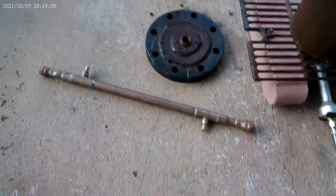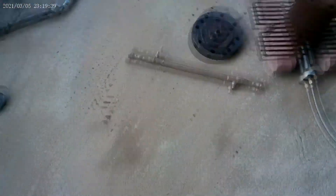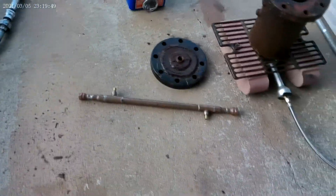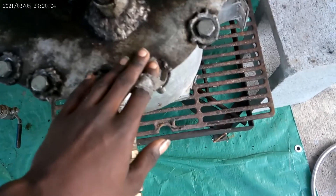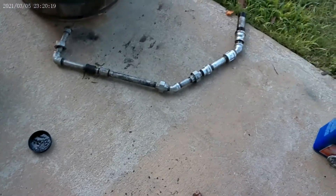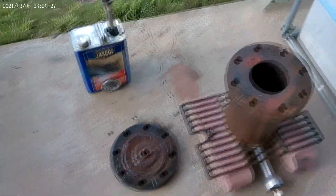My very first live big distiller or condenser — built literally in the first two episodes of my YouTube ever. It doesn't really serve a use in the microwave pyrolysis because the microwaves don't get the stuff hot enough to need this much condensation, but propane does. This reactor has been running all night — literally like 12 hours — and I can touch it, it's warm but not burning me. I touch those pipes after like 20 minutes of running propane and I almost burned myself. That's the difference between microwaves and this process.